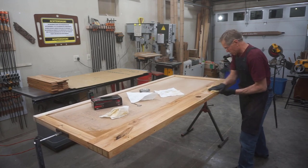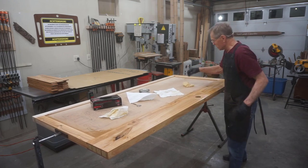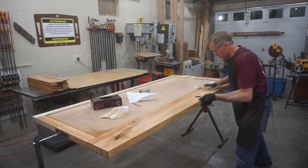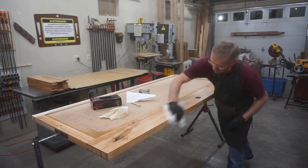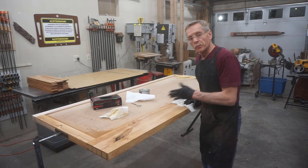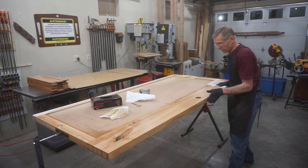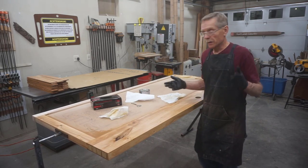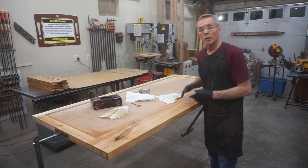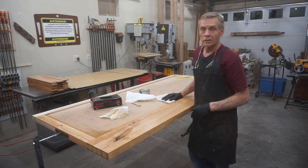It goes from sticky to normal pretty quickly, and then you can proceed with the other step of wiping — no harm done. When that first coat is done, it should all just be perfectly smooth — when I'm wiping here I don't feel any resistance from any varnish that's built up on the surface. I'll let this dry for a good 24 hours after I do the whole door, and then apply a second coat, just because it's a door that's going to be in heavy use for a lot of years hanging in the shop here.